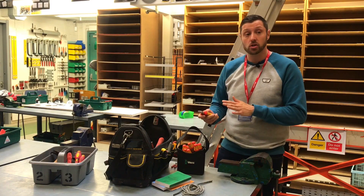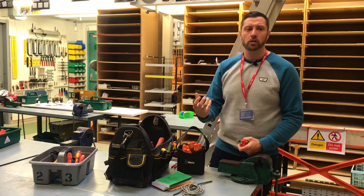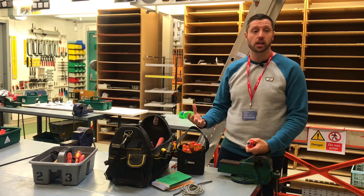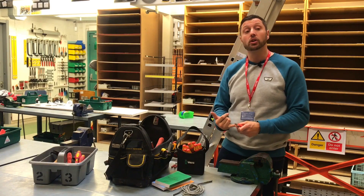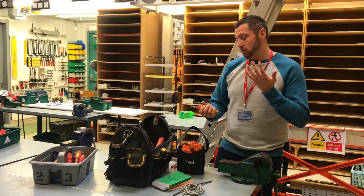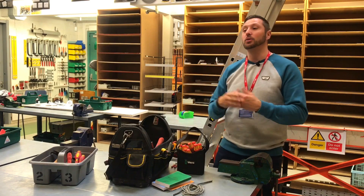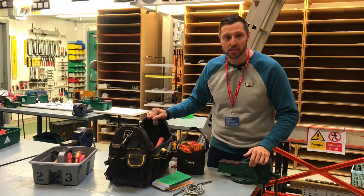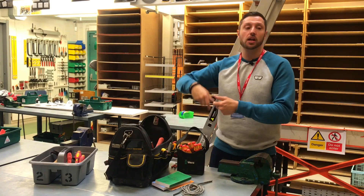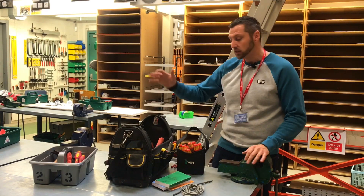Going on to the AM2, I asked if I could take my own cutters. When you're stripping cables, you get used to your own cutters in your hand — you don't want to nick the copper or damage cables. Even with your own cutters from the very start, you do make mistakes, you do start nicking. They become like your hand. On my AM2 they didn't let me take my own, so I did make a couple of mistakes, but you rectify them because you always give yourself that little 10% extra on the cable. If you make a mistake, just cut it off, strip it again.